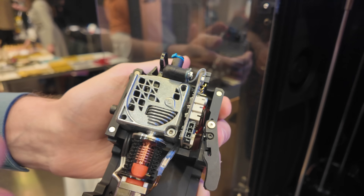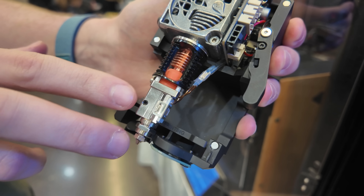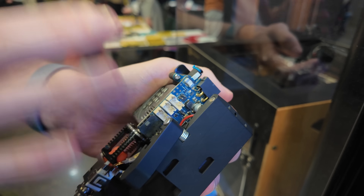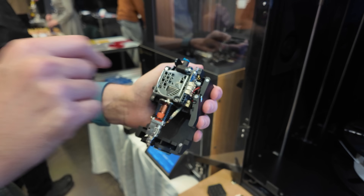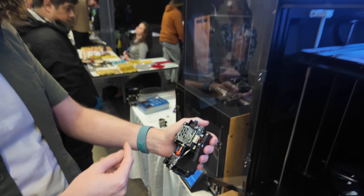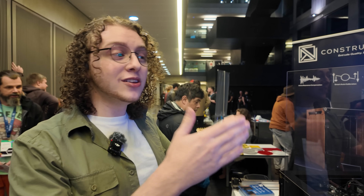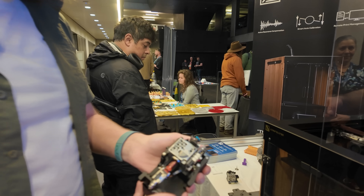The tool head runs a slightly customized Phaetus Dragon hotend with a melt zone extender on the top and bottom, allowing use of a standard CHT Volcano nozzle as the tip — vanadium as standard. It uses a Duet tool board with CAN bus connection, making wiring much easier and improving reliability. There's a flow rate sensor to detect jams in the nozzle and extruder, plus an eddy current sensor for a piezo probe nozzle bed leveling combined with a quick 900-point bed leveling scan over the entire bed.